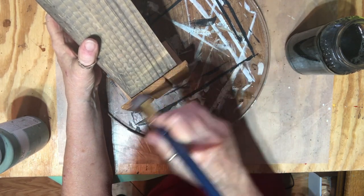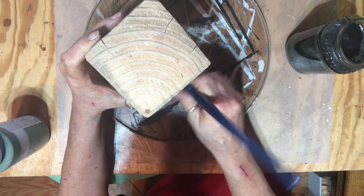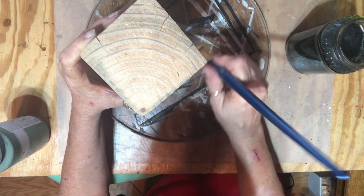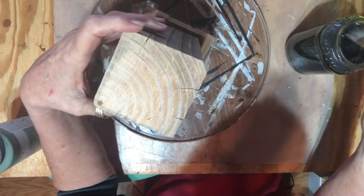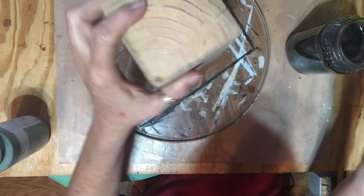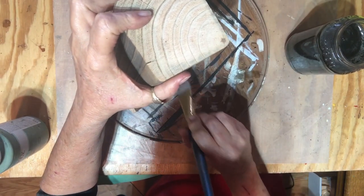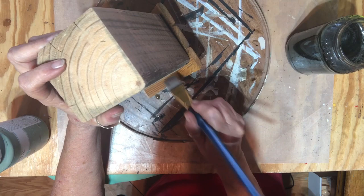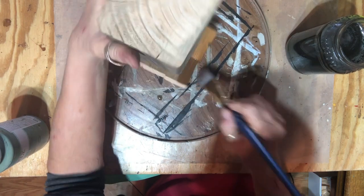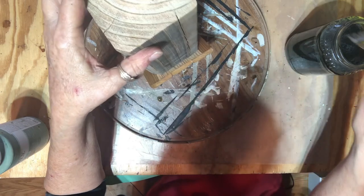Boy, the vinegar smell — hooey Louie! I'm just going to coat this and let it set for a little bit to dry, then move on to the green. I love the way this mixture makes your wood look really old — just white vinegar with steel wool set in it for about two weeks.